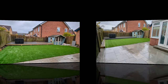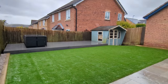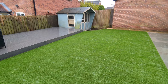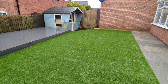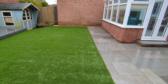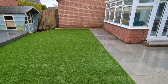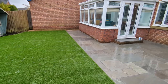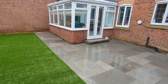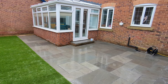Once again it's raining. Another day, another downpour. I've got everything done this morning. Put the fascia on here, got it all the way down. There was like a 20-30mm gap — got a 30mm on the bottom of there just to keep it proper tight. Artificial grass 40mm, supplied by Rodley Simba — Mark Adams, lovely guy, will always sort you out no matter what it is. Indian stone — I think this one is from MKM. And obviously cups of tea from the customer, which are always a bonus.